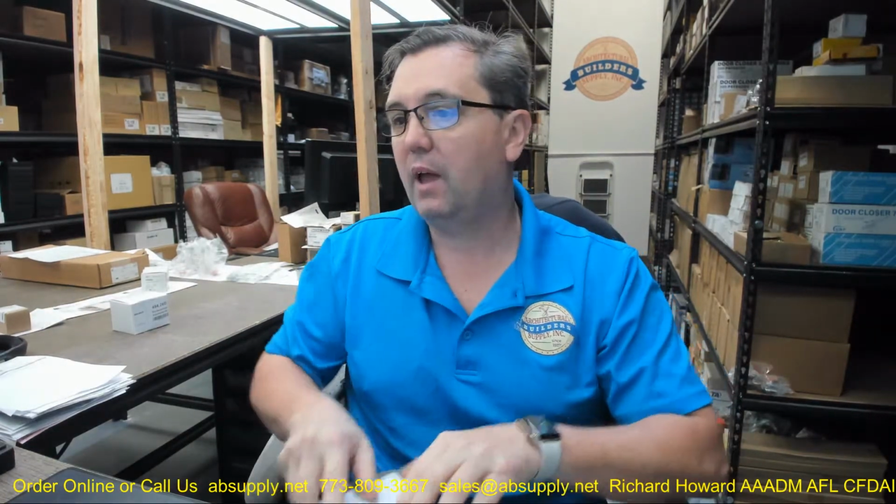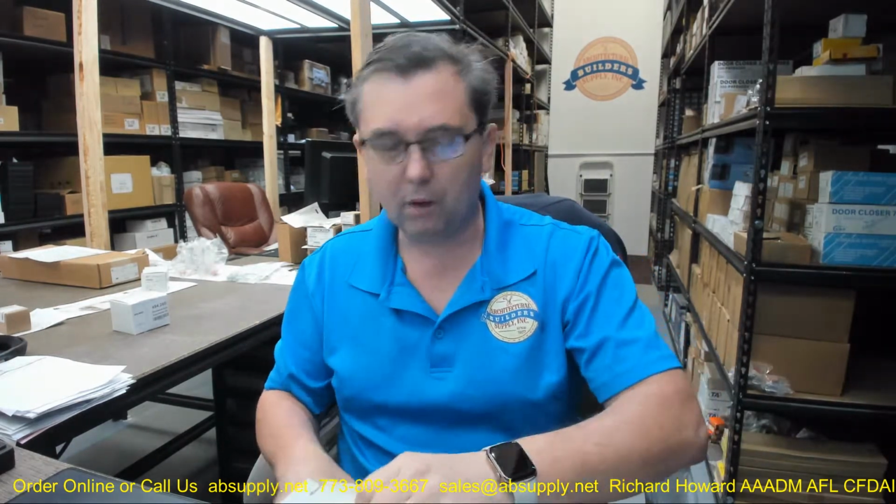In this video is to bring you a closer look at the Rockwood number 494-626. This is a satin chrome automatic door holder. And the 494 is a part of a family of automatic door holders that are all the same in principle. They really only differ in terms of the undercut that they're attempting to accomplish, the strike prep, the strike type that's going to be there for doing so, how it's mounted, where it's mounted, I should say. And the 494 is just a particular derivative of an automatic door holder.